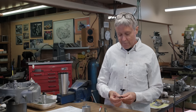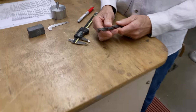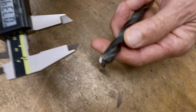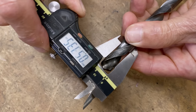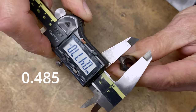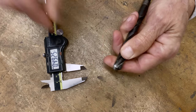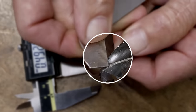I looked in my box and I found a drill that is quite worn. Apparently I must have drilled something quite hard. If you look here, the size of the drill — if I measure it, it's like 485, and then up at the top here I'm down to 470. So this area right in here has become undersized.